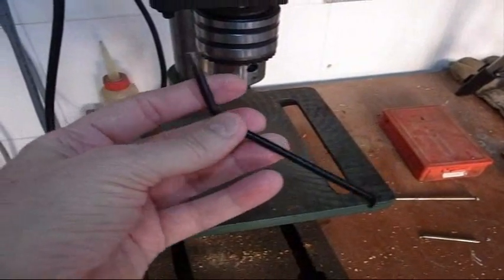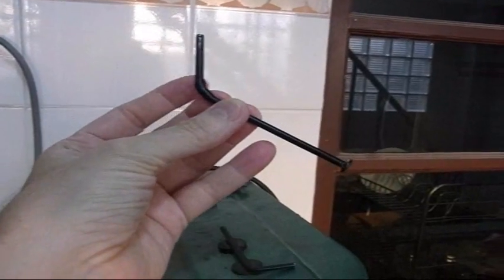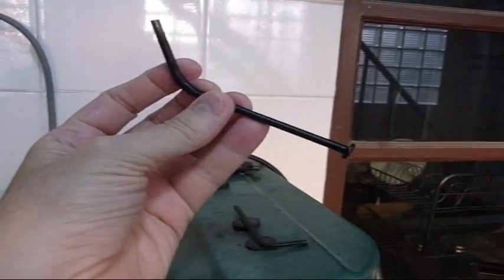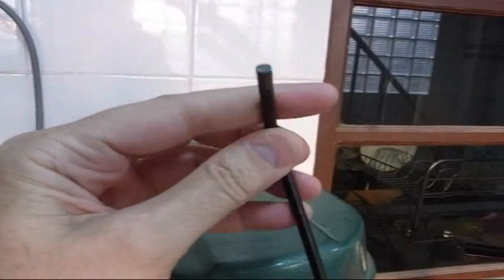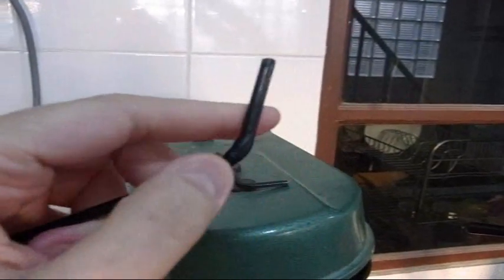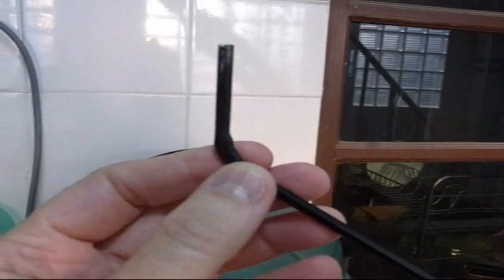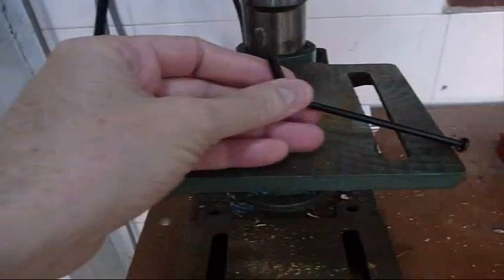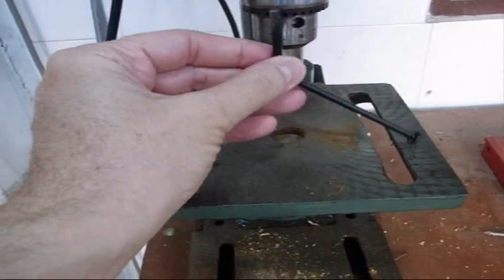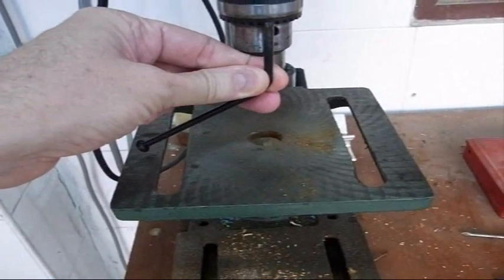The first step is to make a tool — it's a bent rod. This one I welded from two nails because I didn't have the right size stock. You want something very stiff that doesn't bend. The only trick is you want the part that goes into the chuck to be really straight — you don't want it to be corkscrewed or bent in any way because it needs to chuck perfectly. This piece has to reach from your chuck and be roughly the same size as your table.